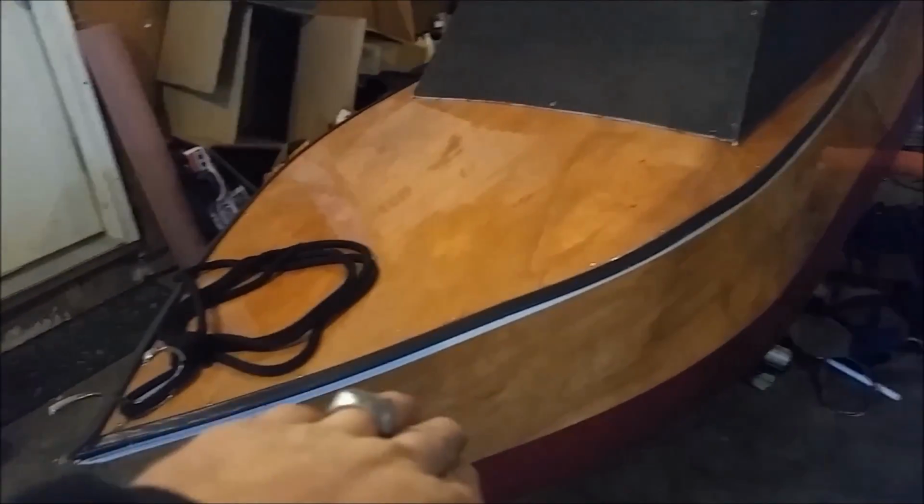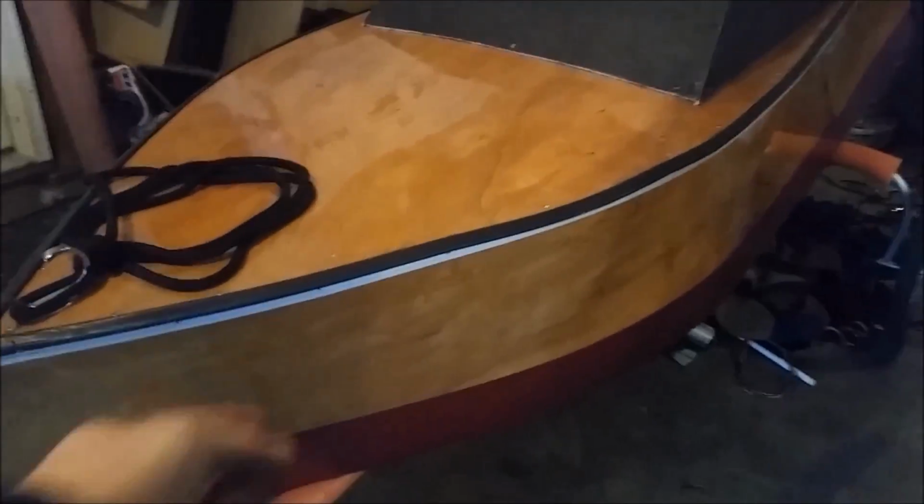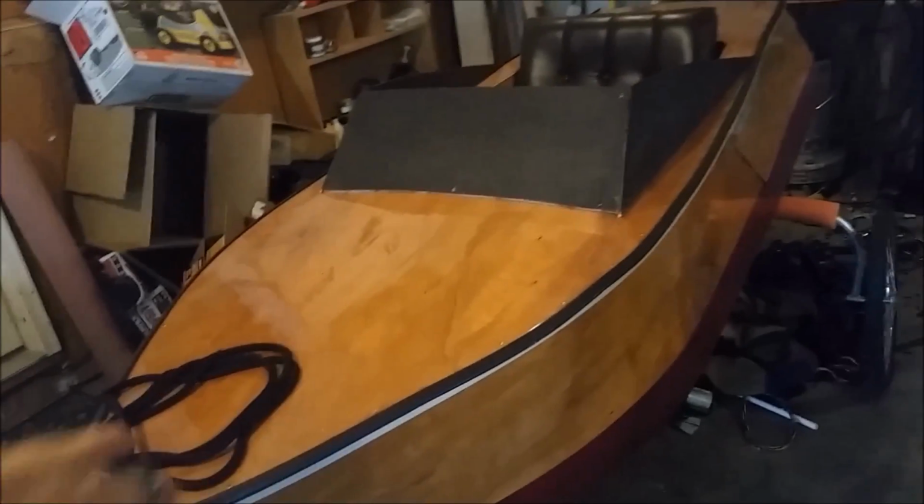I do a quick layer of epoxy, lay the fiberglass, push the fiberglass down, and kind of another layer of epoxy over it. And then I flip the old gal over and do an epoxy on the top, and I use a whole mixture on there, and it gets so thick that it starts dripping over, and I spread that out plus add more of the mixture on the sides and just kind of keep working it and get the runs out. This one I did a lot more keeping the runs out. After it starts sticking and bunching up, you might as well just call it a day because it's setting up and you're just going to ruin it.